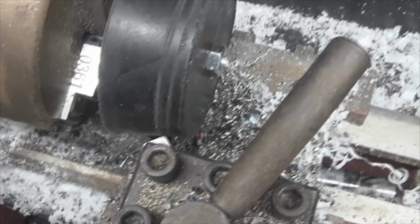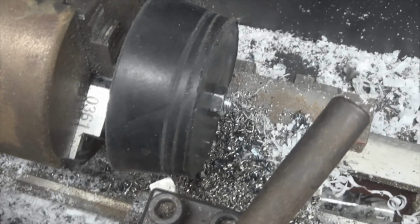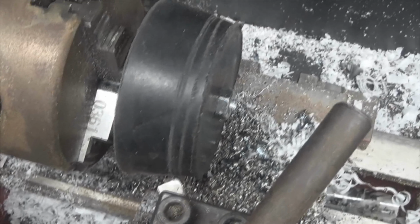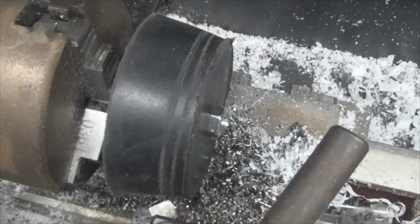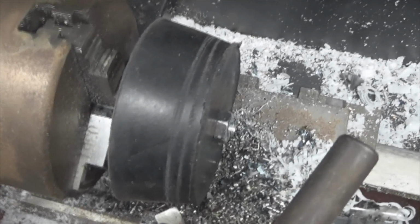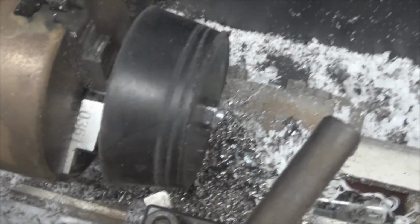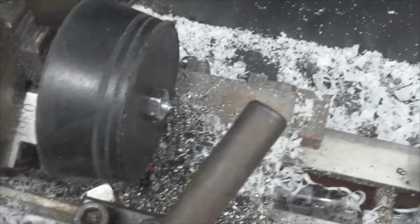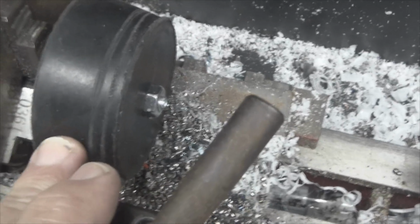Now, when I actually push the casing in, as soon as I've reached depth, I'll be putting in a gravel pack. And once that gravel pack is in place, and I've measured it with a tape measure to make sure that I've got the gravel pack down deep enough and tall enough, then I'll put this plug into the system, pump it up, and start putting pressure on it to force the fluid out of the casing as well as out of the bore.